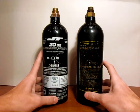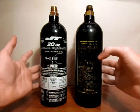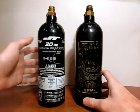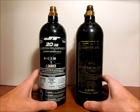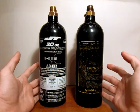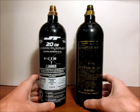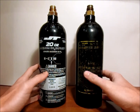Now I know what you're probably thinking: why do I have two bottles out here? The one on the right is out of hydro test, which you can tell because it looks like it has been used quite frequently. The one on the left is much newer — actually from 2013 is when it was made. You probably think the older-looking one won't pass hydro test, but in reality it will pass — I just have not gotten it hydro tested yet, because it's been taken well care of. This is all just regular wear and tear where the paint comes off.